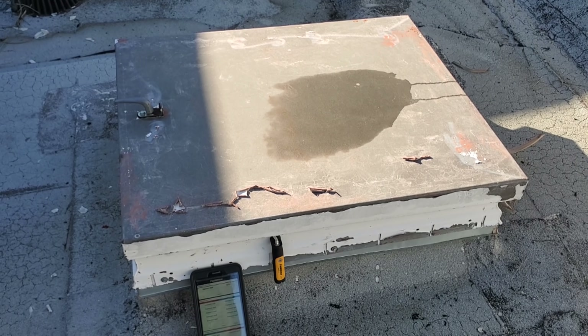I see so many people in my comments when I change a worn pulley saying 'just tighten it down, you're wasting the customer's money.' No — if the pulley is worn out, it's time to replace it. I'm not playing games going back and forth adjusting pulleys to compensate for being worn out. We quote it to the customer and move on. My customers want to fix their equipment properly. And also — do not ever adjust a pulley to try to tighten a belt. When you play with a pulley or sheave, you're adjusting the performance of that equipment — speeding up or slowing down the motor. You want to be very cautious about that kind of stuff.